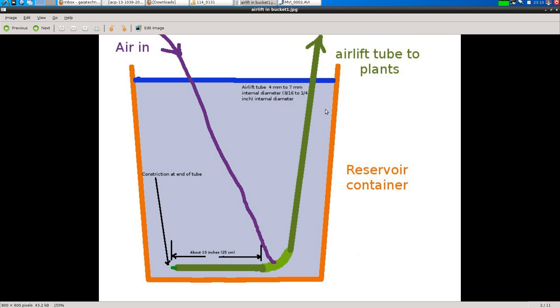As it stands, this is way more useful than I ever anticipated, because I was thinking the minimum submergence was going to be about 18 to 20 centimeters, but now the minimum submergence is only about 9 or 10 centimeters — quite a difference. That means this pump can be used in a whole range of places I never even dreamed of before. Thanks for watching, I hope it makes sense. Thank you, bye bye.